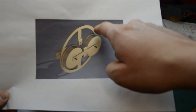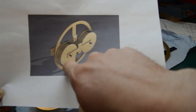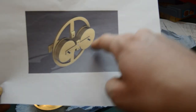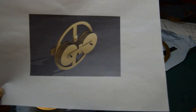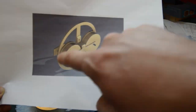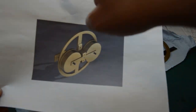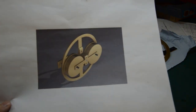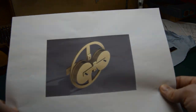Now, this pulley is driven by a pinion, driven by these two very large mainspring barrels. So this whole arrangement gives a long duration of approaching 6 months. The downside of this system is that you've got a huge amount of power on one very fine rope, which is a continuous rope with a joint in it, which has to run through the system. So it has its drawbacks, but is also a very interesting and quite rare system.